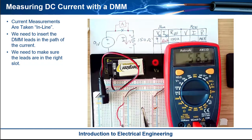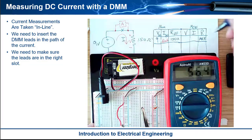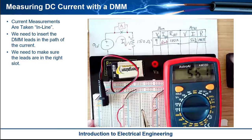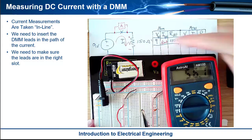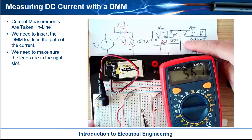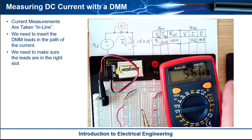The answer to my current measurement is 56.4 — interesting. Current is 56.3 milliamps. It's not quite 60, but what's interesting is I measured the resistance but I didn't actually measure the voltage. Let's go see what the exact voltage is, because it might not be 9 volts.